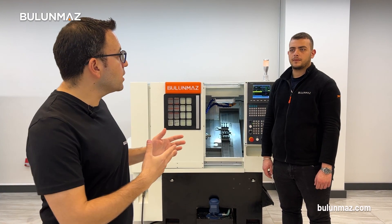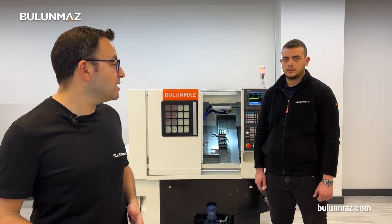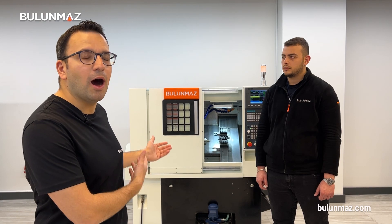The last operation we are going to introduce is the hollow ring with the bottom open — what we call a half hollow ring. There are several advantages and disadvantages. The main advantage is that the weight is less, and since the ring is made in just one top part, the operation time is also less. The disadvantage is that the full hollow ring has a complete solid ring look, while the half hollow ring remains open underneath. Ladies and gentlemen, get ready for our last demonstration — the half hollow ring.